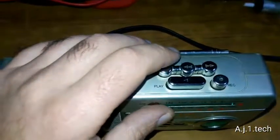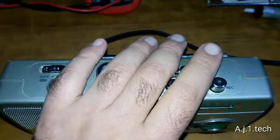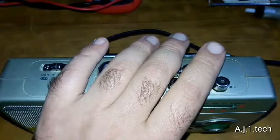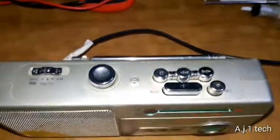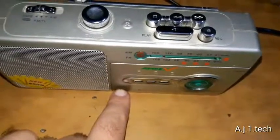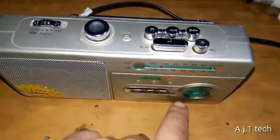Now for the cassette tape. These kind of cassette tape or tape deck units use a special kind of mechanism — it's all plastic, like all of the Chinese mechanics. But there are two types. In China there is the common type developed by Japan for low-cost instruments. It uses push buttons from the top or bottom. In that kind of tape deck mechanic you get record, play, back, forward, stop and eject all combined in the same button.